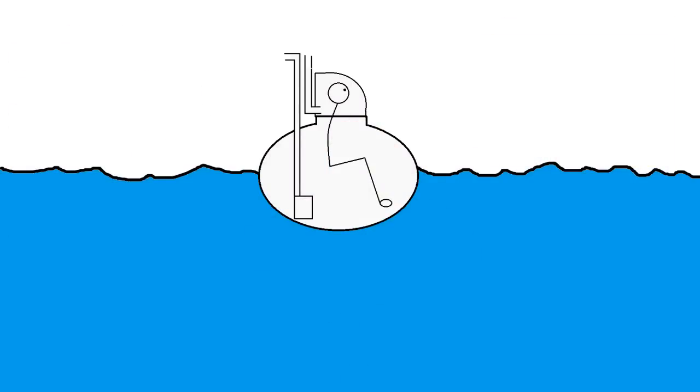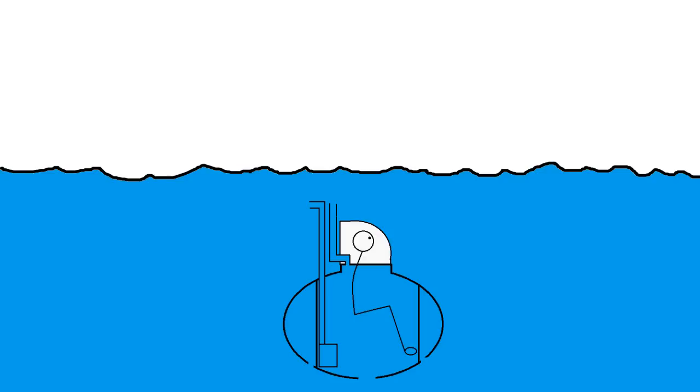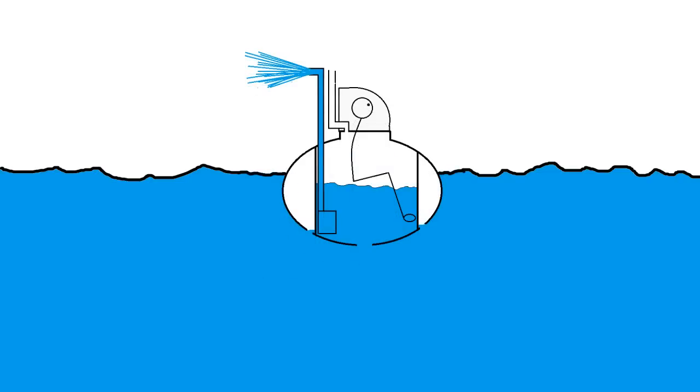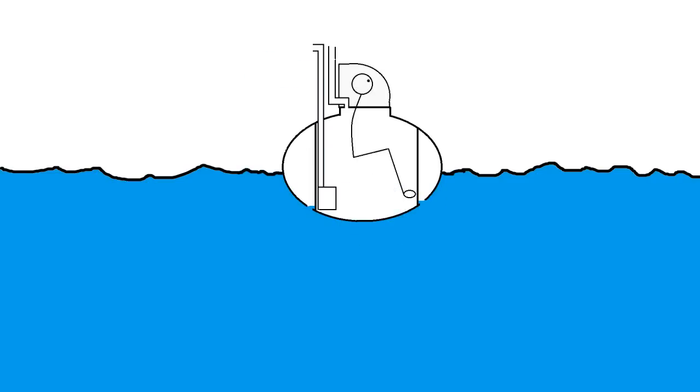So let's look at how my design works. I start off with a totally dry boat sitting on the surface. When I open a large valve at the bottom of the hull, the cabin begins to flood with water and sink. Water comes up to the bottom of the canopy, which is about at the level of my waist. This is what's known as a semi-wet ambient sub. The reason I've designed it this way is that there's less buoyant airspace to ballast against, so the whole vehicle can be relatively lightweight on dry land. To surface, I blow air into the forward and aft ballast tanks, which are just sections of the hull partitioned off with bulkheads and sealed. Once the tanks are blown, the submarine ascends to the surface. The cabin is still full of water, though, so the canopy just barely sticks out above the water. I remove the remaining water with an enormous bilge pump that discharges about one gallon every second. This can also be done by using compressed air to blow out the water, but by using the pump, I conserve a huge amount of air. After a few minutes, the cabin is pumped dry, and the submarine is sitting on the surface again.